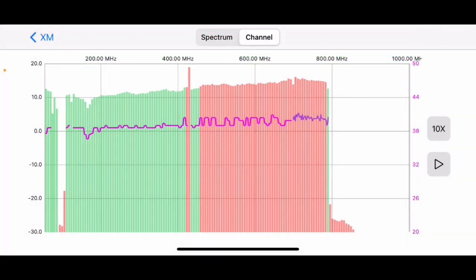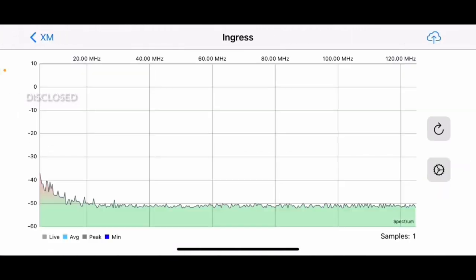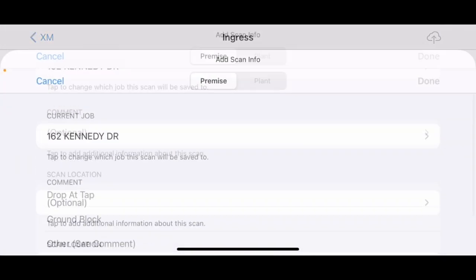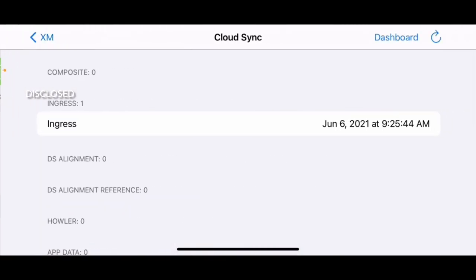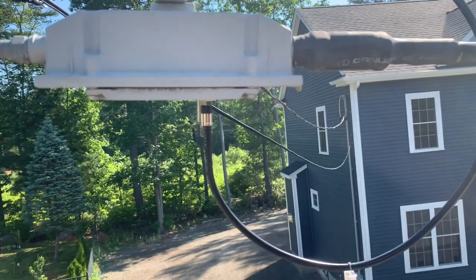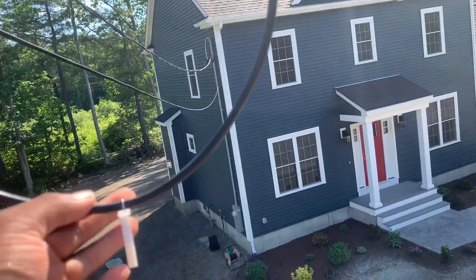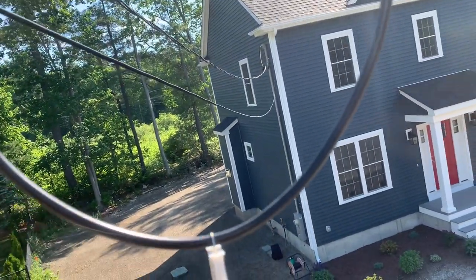Got the checkmark — successfully uploaded. Now scrolling over to the last test: ingress. I'm unscrewing my wire from the meter and plugging into the drop wire. I know the ingress is going to be good since this is a brand new install. Saving the drop and tap — going to uploads. Ingress has a success. Now I've screwed in the drop, got the new tag on it — address 162 — and we're going to continue on to the basement to make more connections.